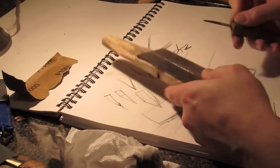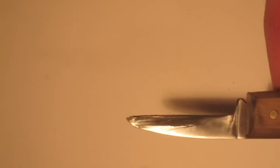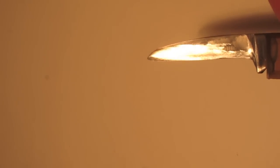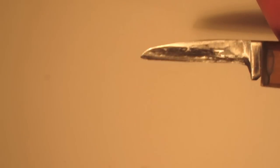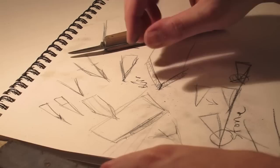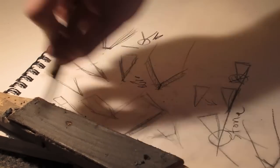You really want to have a zen state of mind when sharpening — it doesn't help if you're rushed or too aggressive. Just relax. After you get this right a few times, you'll know what the payoff is. Looking at the blade now, the burr is just about non-existent. It's starting to look like just a bunch of tiny scratches — frosting or linear directional marks. That's about what it should look like. In real life, without the camera magnification, this looks pretty shiny and almost ready to go.